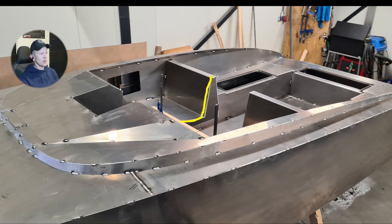These benches were already welded and ground fully as a separate part. If you can build a separate part like a bench and fully weld it first, you'll have it on your workbench and it's very easy to access in every desired position. If it doesn't affect the overall shrinkage of your project, it's completely fine — actually recommended. Same for these U-shaped bent profiles, which were also welded before putting the whole sub-assembly into place.